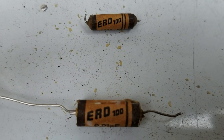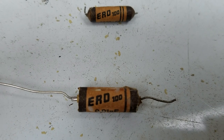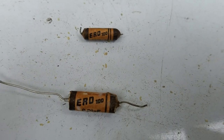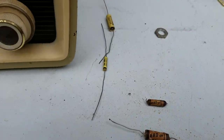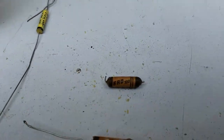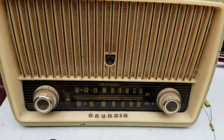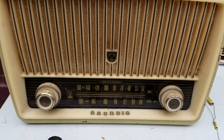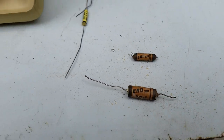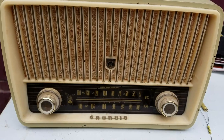These ERO 100 capacitors must be paper — they're both leaky. There were only two of these in the radio and I checked them both — both leaky. I tend to prioritize replacing leaky paper capacitors before electrolytics. I've brought a lot of radios back to life and I've had way more of these short and do damage than electrolytics. The internet likes to tell everybody that electrolytics have to be changed first, but from real-world experience, these paper caps cause a lot more problems. Electrolytics usually just go open and the thing hums — these don't go open, they always short.